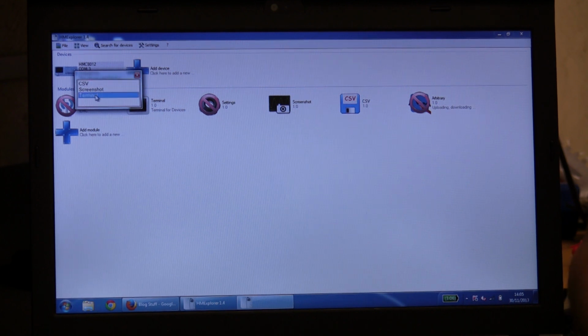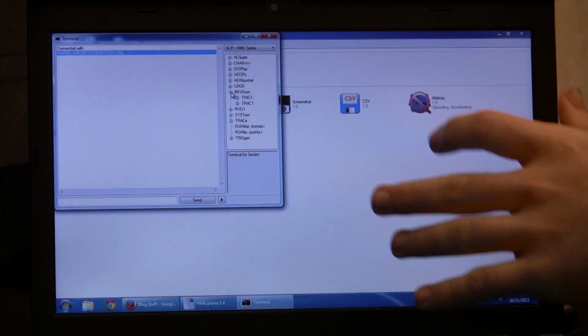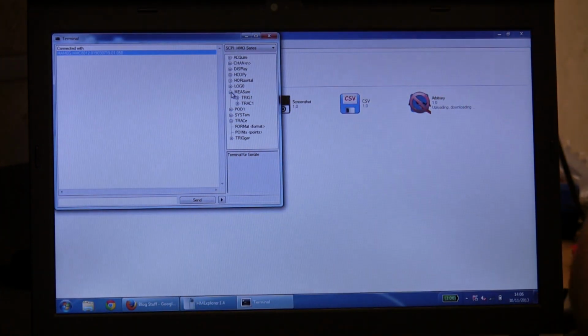And if you're looking at doing automated test equipment or something similar to that, this terminal was a really nice feature and one that I particularly like. So you can actually bring SCPI commands up here. You can start to build up commands very quickly using the pre-built commands in this terminal. You can send them across, see what the instrument sends back, but this will also do things like logging exactly what commands you're sending across. So if you're starting to build up automated test equipment, you can prototype your functionality using the terminal before just bringing those same commands straight into your software, running it and knowing exactly what data you're going to get back.